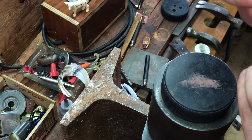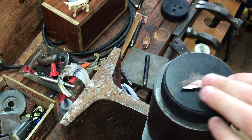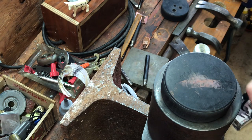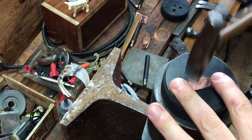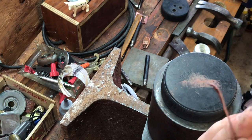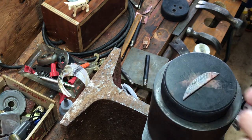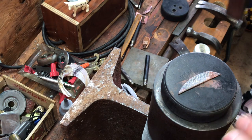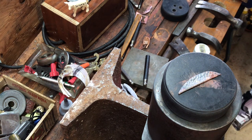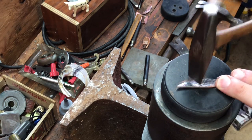So that's it — that's kind of textured. I've got a little bit on both sides. What you can do is anneal and then just start lightly hammering to get a little bit more texture. But you'll see that when this comes out, when I unfold it, it'll be pretty awesome. And that's pretty much it. Let me do one more just to do it exactly the way I normally do. I wanted to try curving the metal and then curving it back to show you how you can fix a formation. So we'll do this on the sides.